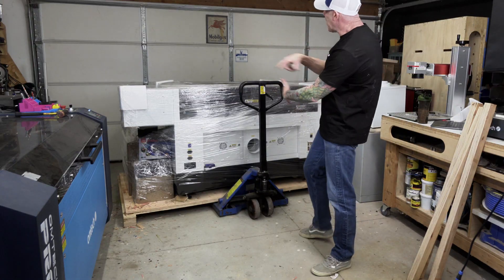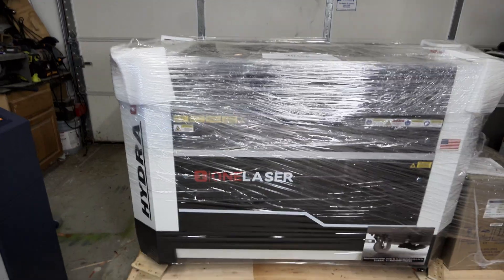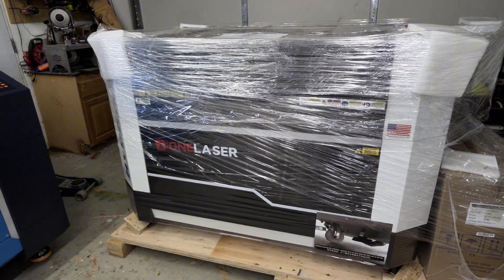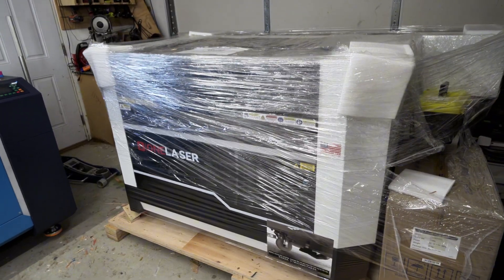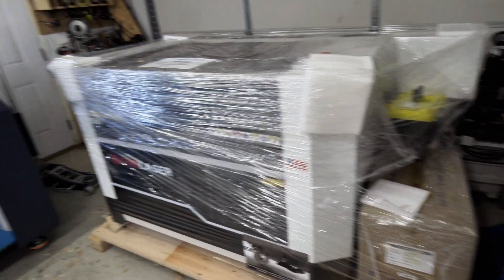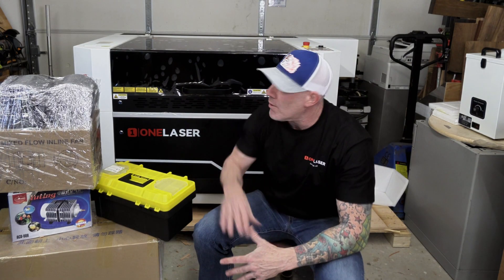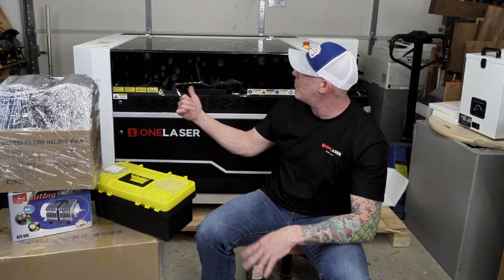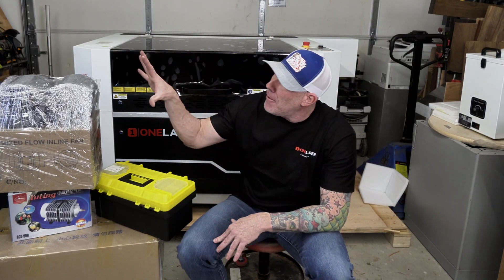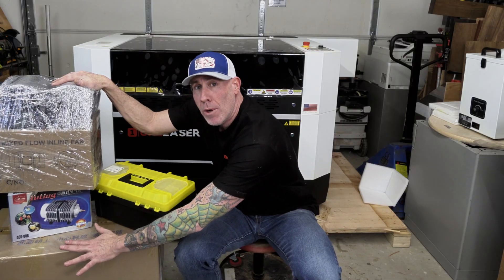Let me see if I can get this thing rotated so you can see the front. That is a really cool looking unit — this is the One Laser Hydra 9 with a 38-watt RF tube as well as a 100-watt CO2 glass tube. Let's go ahead and get the protective wrapping off and get it off the pallet. Prior to moving on, depending on what you ordered, I highly recommend that if you buy a Hydra series laser engraver you're going to need a water chiller — that's going to prolong the life of your laser tube and keep it consistently performing well without losing power.